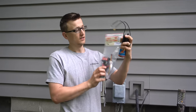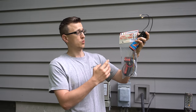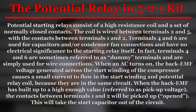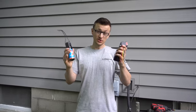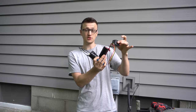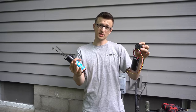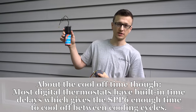In those other areas, maybe the 5-2-1 is a better idea because it's gravity assisted instead. Once there's enough back EMF, or once the compressor is up to speed, the relay in there drops down and takes the start capacitor out of the circuit. So in the end, which one is better — the 2-wire hard start kit or the 3-wire hard start kit with the separate potential relay? The answer is the 3-wire hard start kit is better. It functions better, it's better quality, and it doesn't have that cool-off time like the temperature-operated one does.